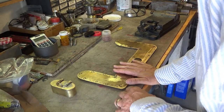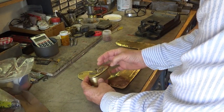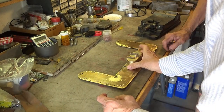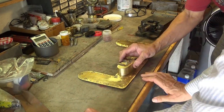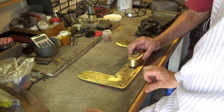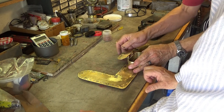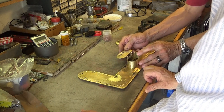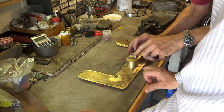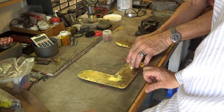All right, so here we're on the bench. Bob, you got this laid out — nice job on this. This cap goes here. That's correct. Now, that's the original builder's work. I made a little repair work on it, but he gets credit for that effort. That's going to be soldered in the center of that hole, which we can view by opening this up. We center it on the hole position. I clamp it down with a clamp and a bar, and then I'm going to heat this up with a torch and make that solder joint.